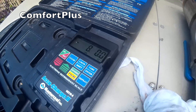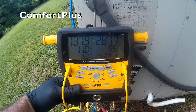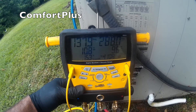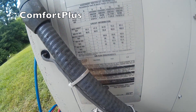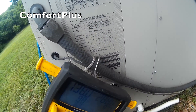We got eight pounds in there — let's fire this puppy up. She runs. Superheat's a little low, but it's also cooled off inside the house since I've had it on. The unit called for 128 ounces and that's what I put in it, so I'm going to let it eat.